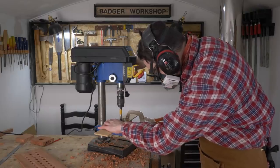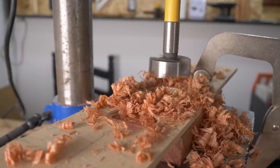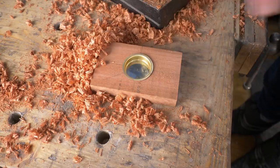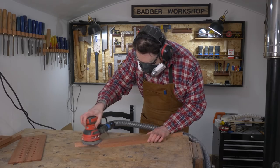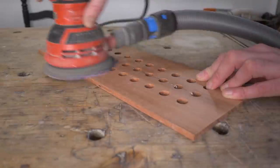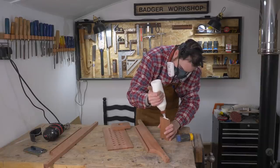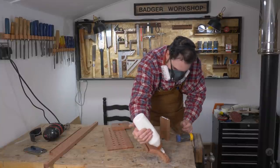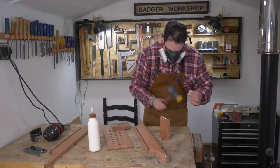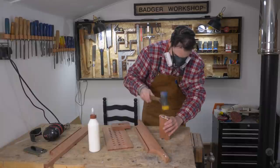Before I get it put together I am just going to drill a large hole in each of those end bits — this is going to receive a little holder for a tea light. I give all the components a quick sand down going up to 120 grit and then I can start getting it all put together. I get some waterproof PVA wood glue put into the holes, spread out, and then the dowels tapped into place. Then all the components can be put together and clamped up and left to dry.